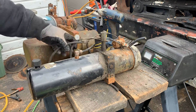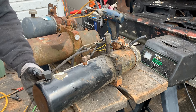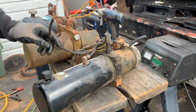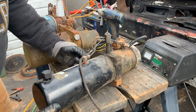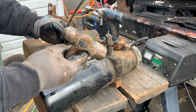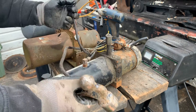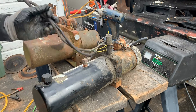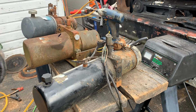This one probably had a switch panel on it. This particular one is a Maxon — Maxon makes lift gates, so this is probably off a lift gate. It had two lead wires: probably one was on each side of the truck or one was on a handheld remote. So this was set up for two controls — you can see they're just wired together. It uses one solenoid.